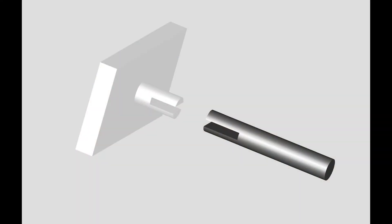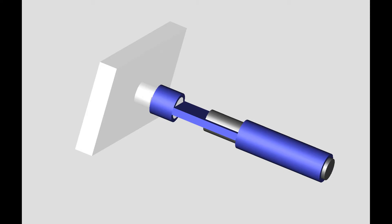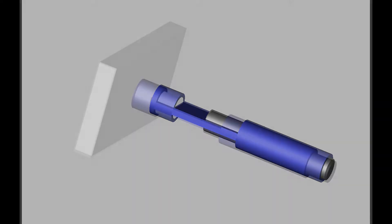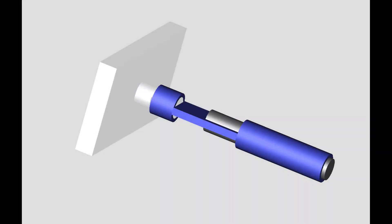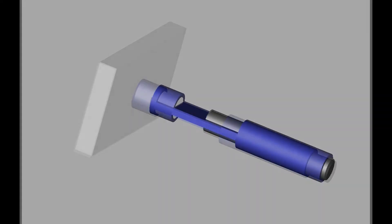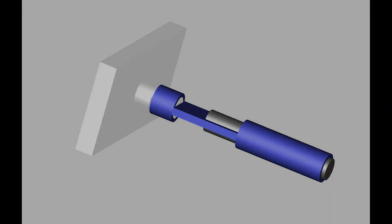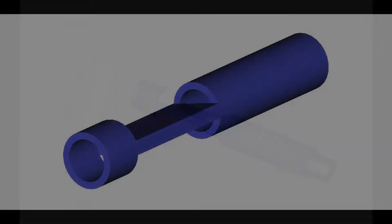This is the model of the motor shaft and the lead screw, and this is the design I am going to implement. It is just two sleeves connected by the key. The shorter sleeve runs along the motor shaft and the longer one runs along the lead screw. This is how it works.